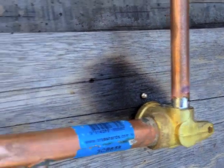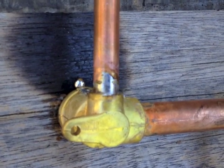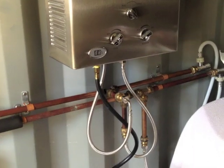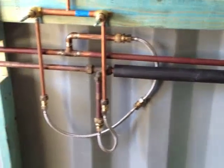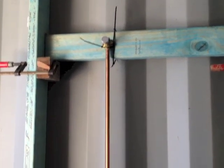Here's the joint finished and when I tested it, it was watertight. I've plumbed in the shower breech to the hot and cold lines. I've also extended the hot and cold lines to the left. I left it pressurised overnight and it's watertight.